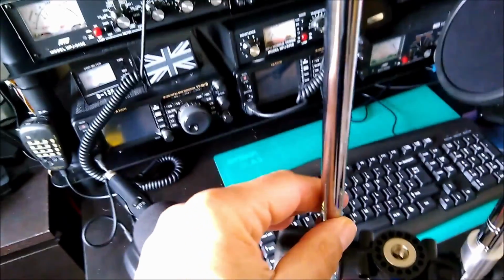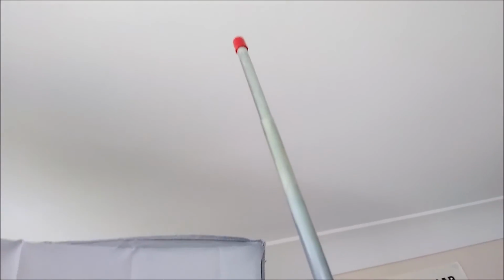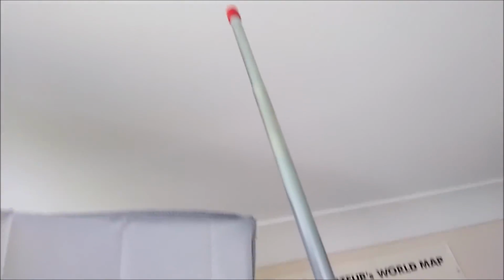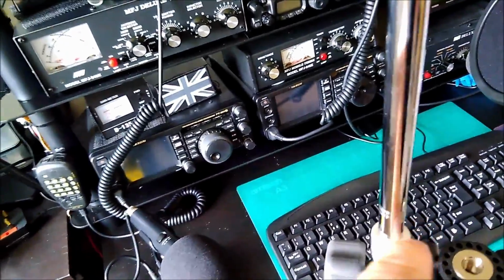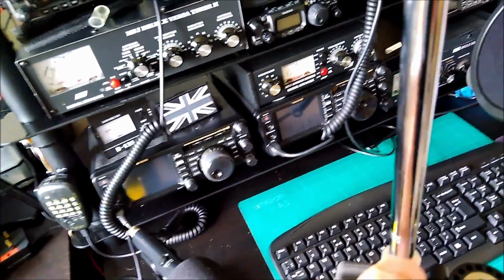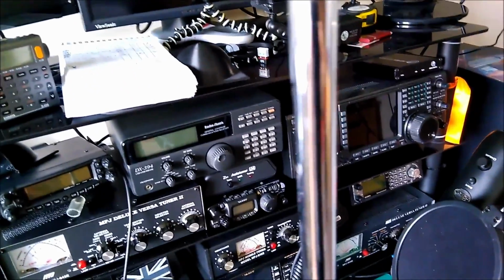Now this measures all the way, I can't obviously show you, but where you've got that red rubber cap. So the measurement goes to the top of that cap, down to where it actually goes on the rotating arm. So from the rotating arm, top here, all the way up. So the radiating element is 43 and three quarters of an inch long,